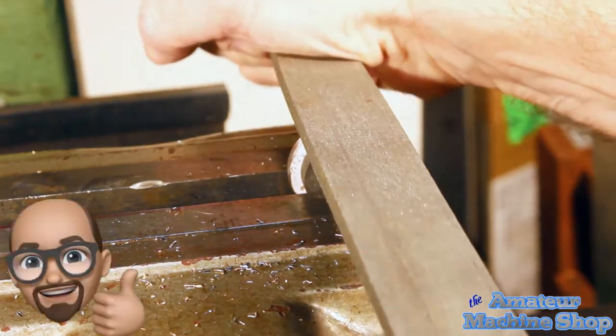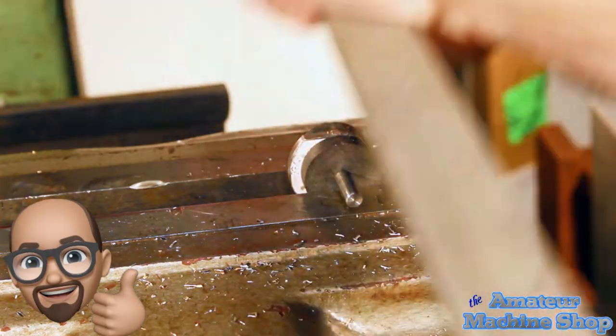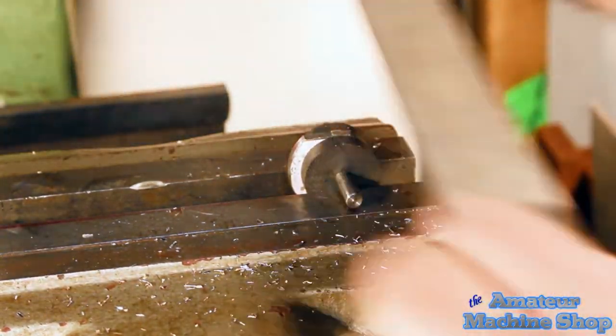The added guides didn't get all that hard. I thought it was 1045 steel shaft, but I'm guessing it was mild steel. Otherwise, the file would just skate off the surface as it would be hard. Nonetheless, it worked.